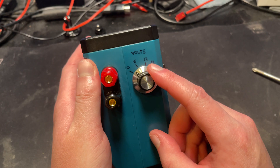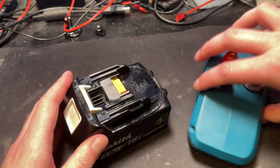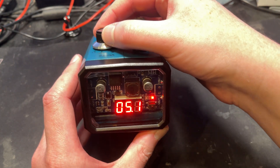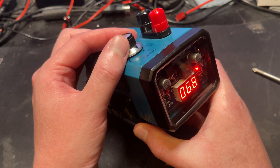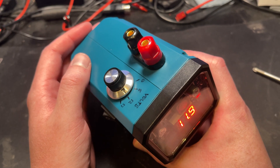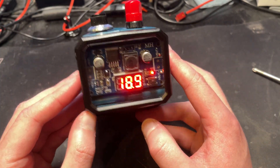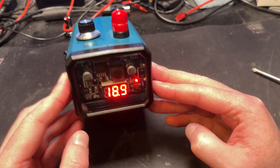These markings are actually now correct as well. In Blue Peter style, I have here a 5Ah Makita battery. It works — that should be around 5V. We're at 5V there. That should be 12V approximately — it's quite sensitive, but really that's fine. It isn't meant for accurate voltages. And then you go all the way up — in this case up to 18.9V. Didn't realize it would go quite that high. That's obviously the battery voltage that it's getting. Didn't realize these batteries went as high as 18.9 — I put 17 on there, but it's close enough. Nice bright screen.